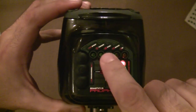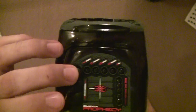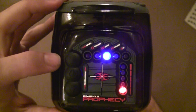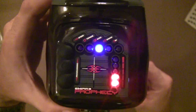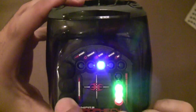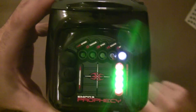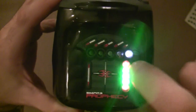As we go through the diagnostics, you'll see along the top — when it's looking at the eyes, the sound, or the RF — the relevant LED is lit up. Up button, push power, all the LEDs come on. Up, doing all of the eye sensors right now, so this is blue. Not getting any balls. Gets the carrier, gets the drive gear. Now we go down — now it's listening for the sound signal, gets the sound signal. It's listening for the RF, doesn't get an RF, so it's just going to default and go red.